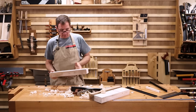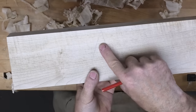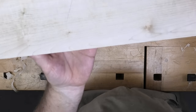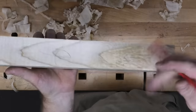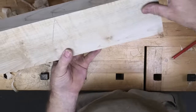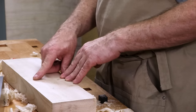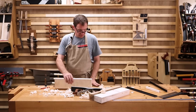So at this stage, we have on here, hopefully we can see on the overhead, we have our arrow if I bring them back in. So we have our arrow, face side, we want to do face edge. All right, so we have our mark coming off that identifies where we are. All right, so arrow we did earlier, face side, face edge. So we know this is now flat, this is level, and that corner, if I drop them right back down here, remember we said about the corner earlier? That means now that's square. So that's done the first one. All right, so we got edge, side, that's the first bit.